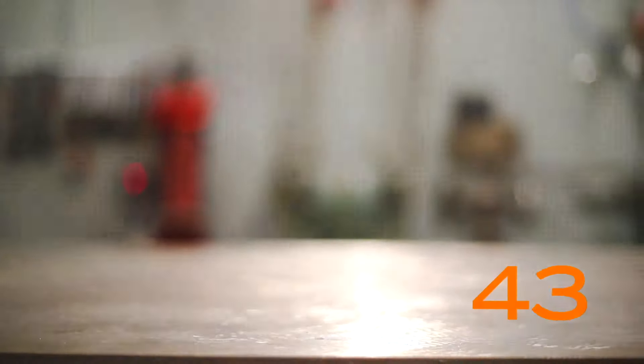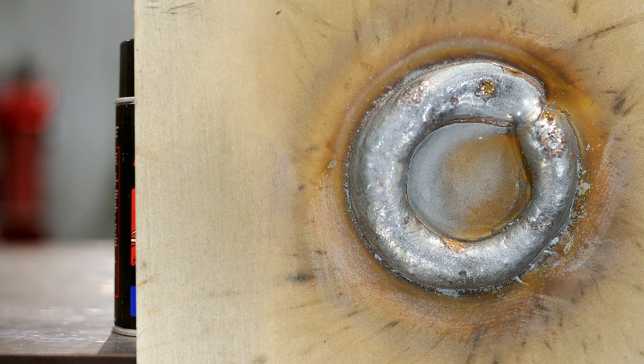The Osborne powder also did rather well — it's a light powder that sticks to the metal when sprayed. The Radnar anti-spatter spray shows almost no spatter on the outside or inside, but did leave a light film behind that could interfere with the paint test. The ceramic spray also did a good job with just one light BB in the center. The worst performers: Simple Green left a lot of spatter and nasty residue, Mountain anti-spat resembled the control closely, and Metaflux left a lot of residue and didn't perform well.